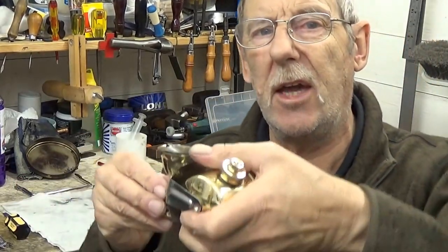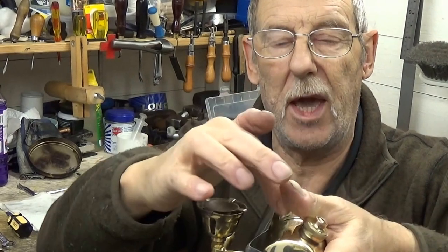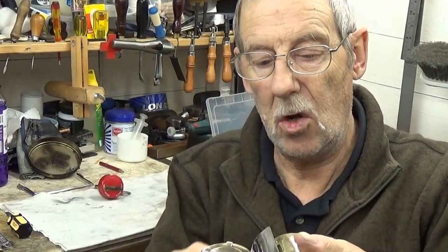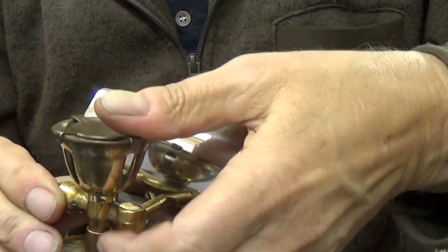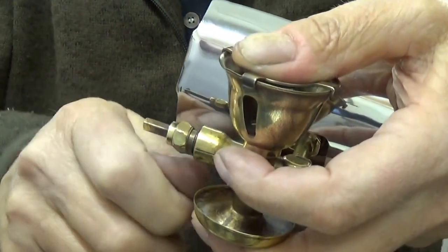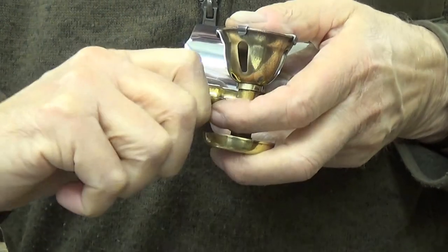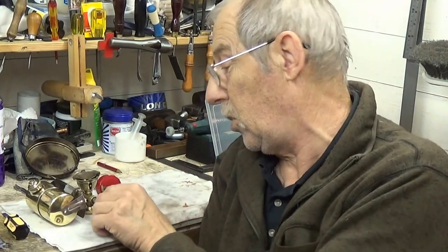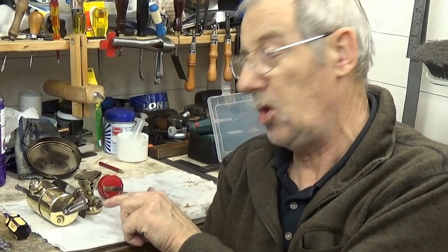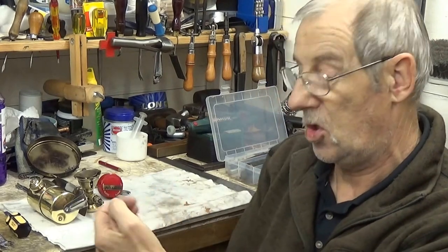Just be careful — a lot of people tend to just hang on to the tank like this and then crack it. Well you're going to bend this little shaft or put it out of shape to the tank. So I tend to hold the whole shaft here and tighten this up so that you can put it against yourself and just crack it up. You don't over-tighten it but it wants to be tight. Because once it gets hot you've got pressure running out of there — that could spit back. Which is what happened when I first tried it out: it was shooting out here with a yellow flame, coming out the side of the metal can. I thought that ain't right, so I turned it off straight away before I ended up with a fire.